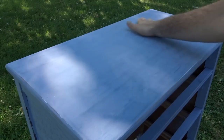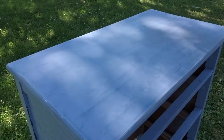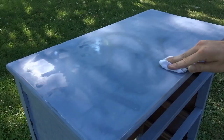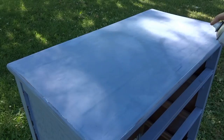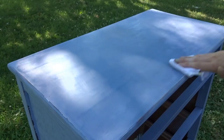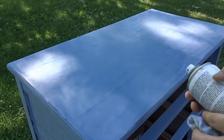Everything is now painted and distressed, ready to go. I wiped it down and now I'm going to seal it with wax. They have a sealer and a wax, both in spray cans. You just spray it on in a crisscross pattern and then polish it on with a cloth — pretty simple. It should make the color look a lot more rich, since chalk paint looks kind of dusty and chalky before you add this. Really easy to use, and unlike paste furniture wax you don't have to wait for it to dry. Doesn't really smell like anything either.